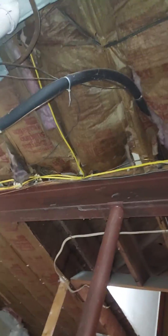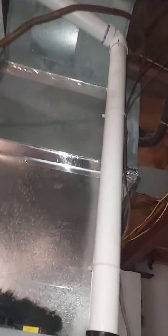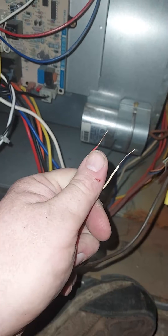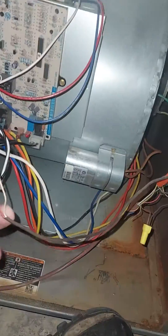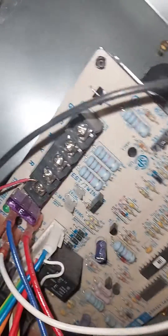Black, brown, blue — as long as the board and the thermostat up there match, that's all that matters. We've got two extra wires here; the line set tells me there's a coil and a drain, so we have air conditioning. This is your control voltage wire to connect your thermostat upstairs to the board, where it's going to energize the contactor outside.